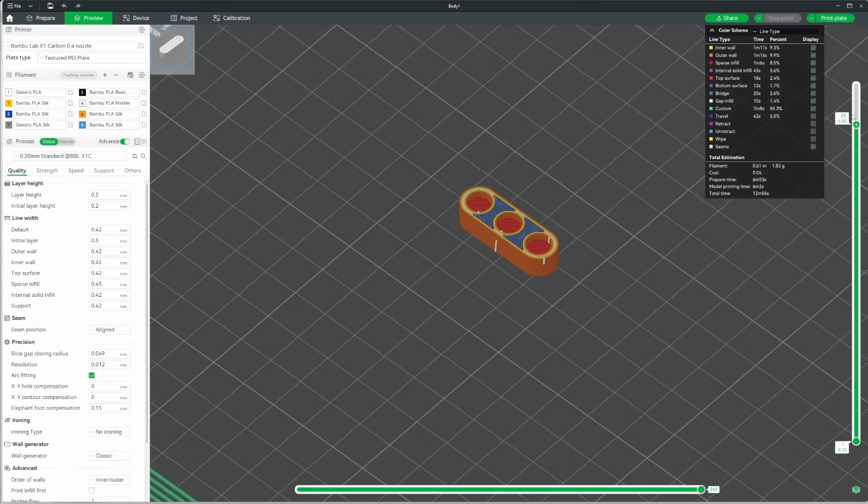Using the up and down keys on the keyboard is an easy way to step through the layers. You can see as this prints it's going up, making the hole for the magnets, and right here is the final layer where you want to drop the magnets in — then the next layer starts printing over the top. So how do we get it to stop so we can put our magnets inside? You need to slice the plate, then scroll up and down until you find the layer where it transitions, go one back, then right-click on the plus button and you can add a pause.